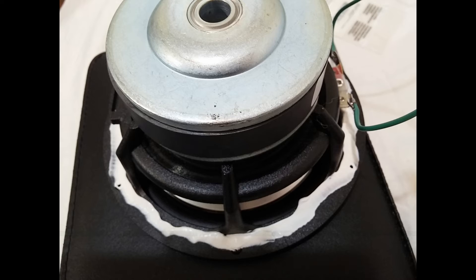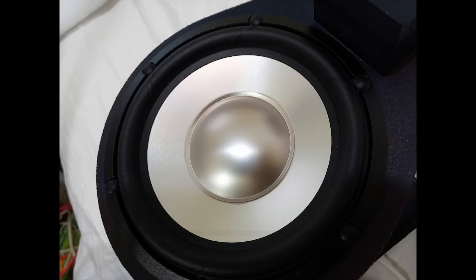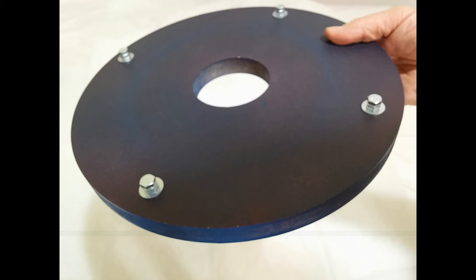Learn from their silly mistakes: use the clear silicon and it'll be a lot easier to clean up. Here is the other low-frequency driver getting ready to be glued into place — got the bead applied, kind of stuck a little more to the inside surface of the underside of the mounting part. No actual screws are used holding any of the drivers in place, other than the high-frequency driver being clamped from the sides. The actual mounting holes are not used for any hardware for either the low or high-frequency drivers. This one went in place very cleanly — simply by being more careful, I had no cleanup.